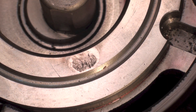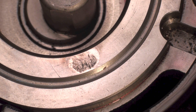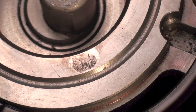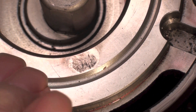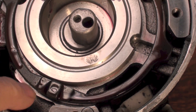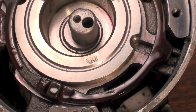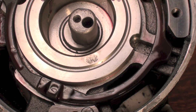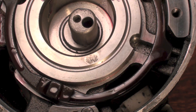Now I'm going to show you another part. What I'm looking at is right here — that appears to be the same type of mark that's on the oscillating spiral. Now this is solidly mounted — this thing is actually mounted to the side of the compressor can, so that's solid and the other part is oscillating. They have to move together; this is a bearing surface between the two.